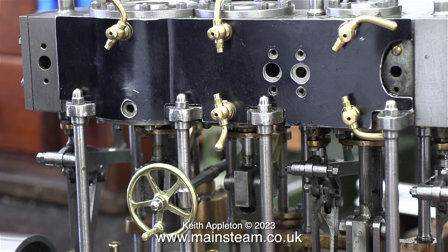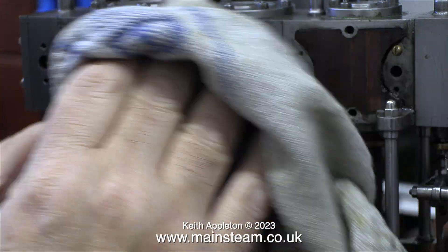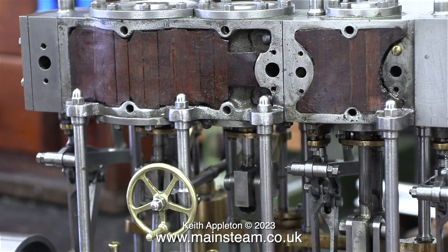As you can clearly see in this clip, the cladding is not good. It's really difficult to work with — it's aluminium that is anodised and it marks and bends and dents very easily. The cladding of this cylinder sort of developed; originally I did the other side and made a really good job of it, but once I realised that the mahogany wasn't going to work out as a finished item, when I fitted the mahogany to this side it was pointless to take too much time — that's why it's not as neatly done as on the other side. I decided to use this inner cladding not just as heat insulation but mainly to support the very fragile outer skin. It's a bit oily because when I fitted the piping I didn't tighten it up and it didn't seal properly.